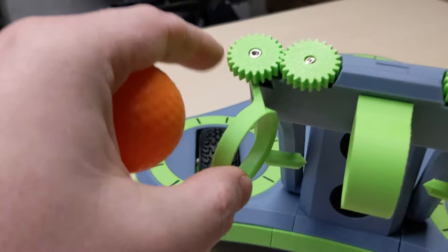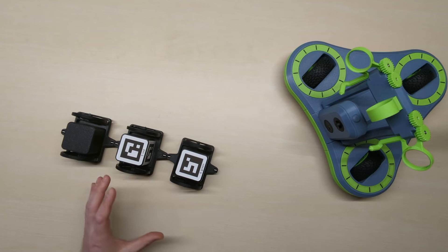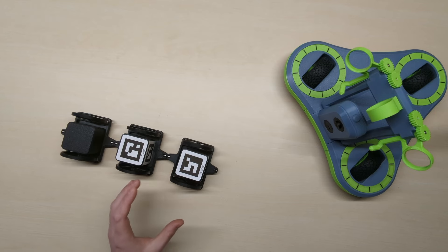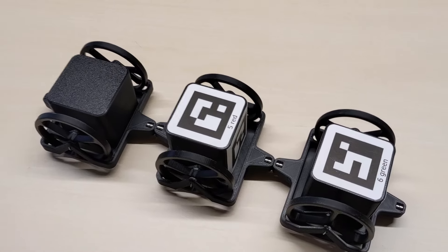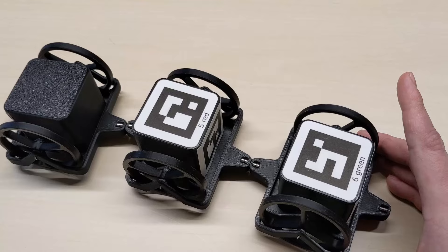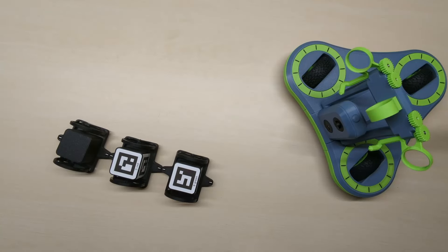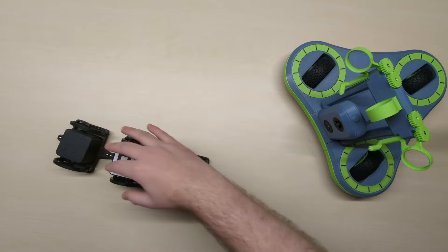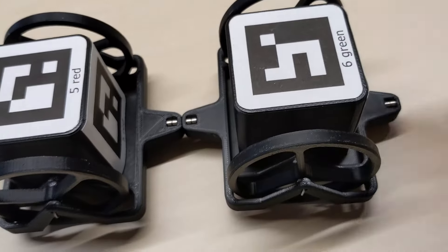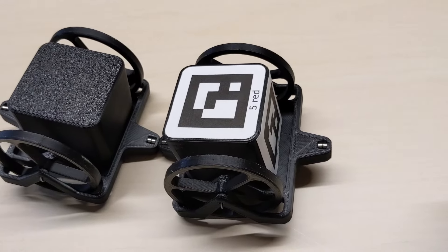You may notice that the side arms also have a spike on the end, and this is for another obstacle on the track. The obstacle is these carts with QR codes on them — each one has a different number, and you have to separate the carts and put them in front of the house with the same number. It turns out that separating them is not easy; they are attached by magnets. After various tests, I found out that the best way to separate the first cart from the last one, without moving the remaining ones, is to pick it up by the wheels and lift it upwards — this way the other carts almost don't move.